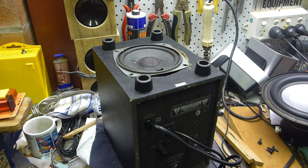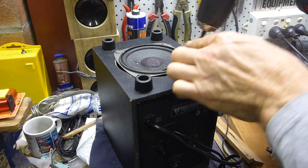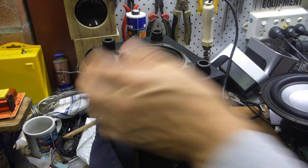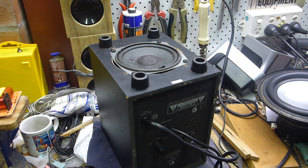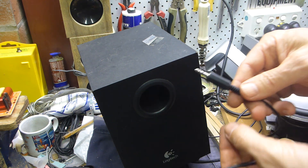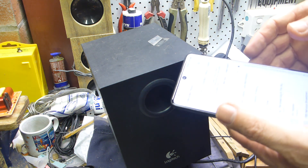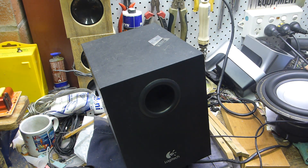So that's a wrap. This really shows that the speakers Logitech ships with these really can't be improved on. I put baffling in, I changed all sorts of drivers — obviously I didn't put in a bigger amplifier, which is a bit silly — but it's really proven that mixing and messing with the Logitech factory formula is a bit of a waste of time. I actually pulled this apart because the original 3.5mm plug was stuffed and having dropouts — the dropouts I was experiencing were not from my phone's headphone socket, they were from the dodgy plug. It sounds terrible anyway. Cheap speakers — as always, thanks for watching.